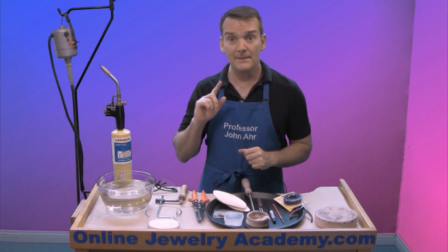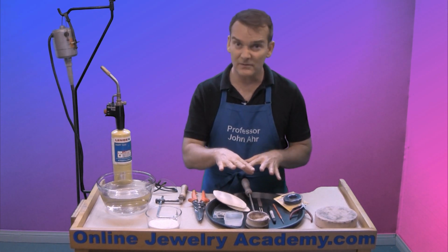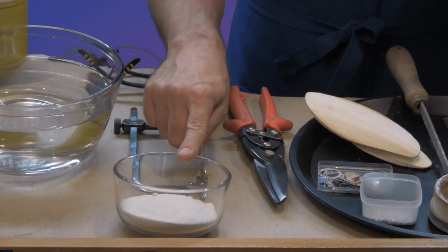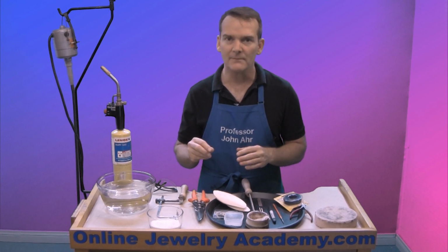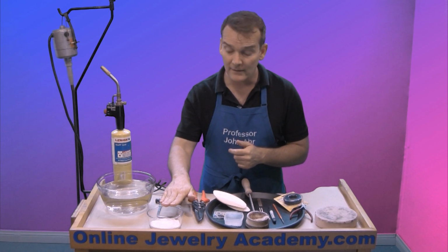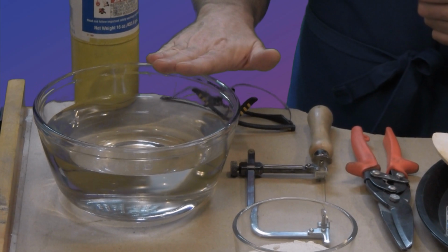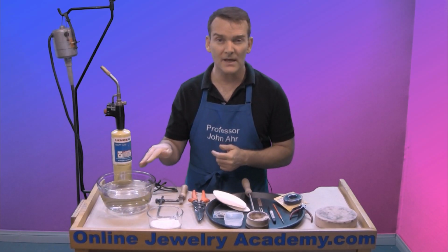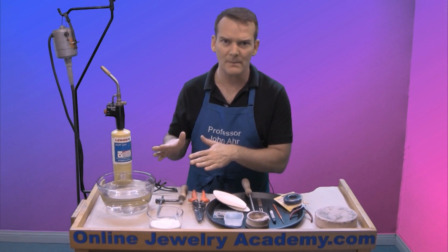All right. The magic that makes all of that happen in the crucible, to melt everything so we get a casting, is this material. This is casting flux. It's basically borax soap. So if you're on a budget, you can get something like Boraxo 20 Mule Team soap and it'll work just fine. Now, we also have on the table here a bowl of water, which when we're done with the casting, we want to submerge it in so that it stops the smoking of the cuttlefish bone and reduces the smell.